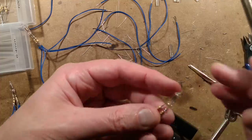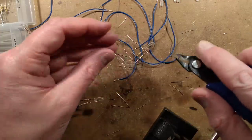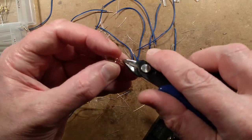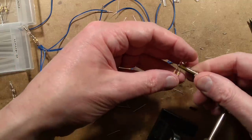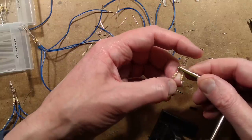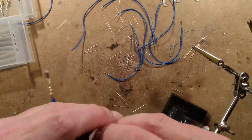That's slightly peaky - I'll crop that little peak off again. It's just because I'm not flowing it on directly and the flux is drying out a little bit. It just makes it a little bit easier to put together. Crop that down, put it back in, and solder the wires on. Once you start making this, it all flies together - you get into the sort of pattern, the rhythm if you will.